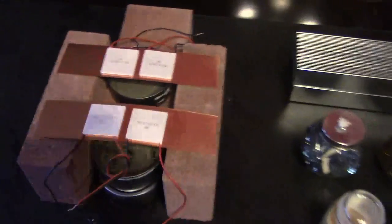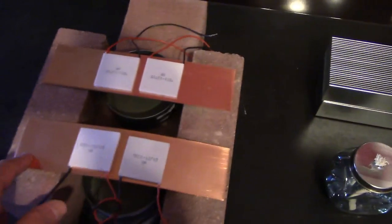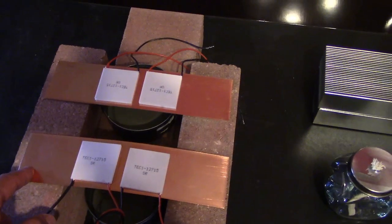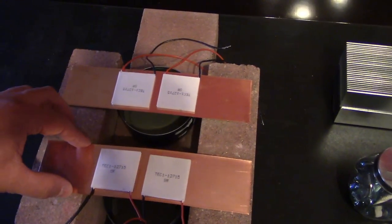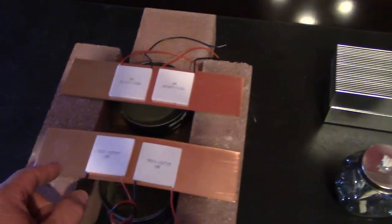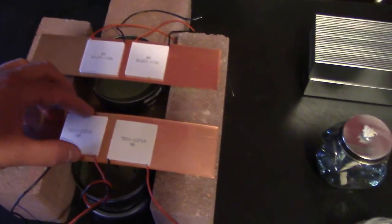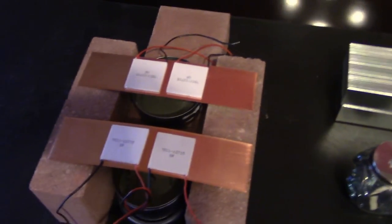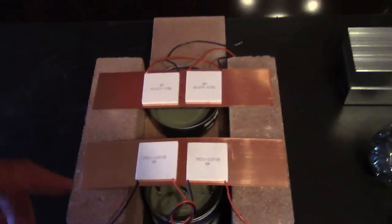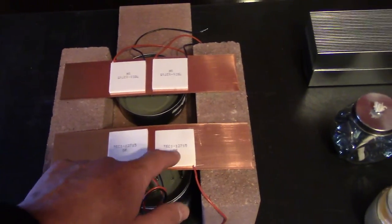So just to wrap it up, I wanted to mention one more time why I just use two chips and why you can't use more than that without thermal tape or glue. That's because the heat sinks like to put all their weight on the end chips — if you have three or four in a row, the ones in the middle are always a little bit looser. That goes for thin copper that bows a little bit, or thicker aluminum that doesn't bend at all. The only choice would be thermal tapes or glue, but that's a terrible idea because it's not necessary if you do it this way. If even one chip goes bad, ripping it apart is a nightmare. Just go with two and two — if you have to replace a chip it takes two seconds, and for the record I've never burnt out a chip doing it this way.